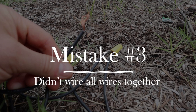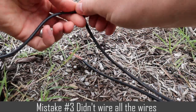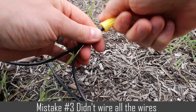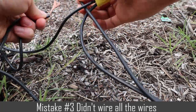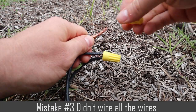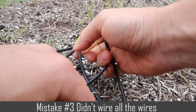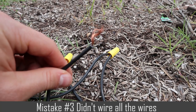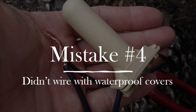Number three is not wiring all the wires together. This goes along the same lines as the first mistake. When you're wiring up the wires, sometimes — let's say there are three wires that need to be wired up together — you need three wires with writing and three wires with rough edge. But what ends up happening is sometimes I'll put three together and then two together, and one wire is just hanging out, not attached. I'll put the light in the ground, come back after checking, and it's not working. This happens a lot more when you have more wires to connect — say five or six — and you wire six on one side but only five on the other, missing one.